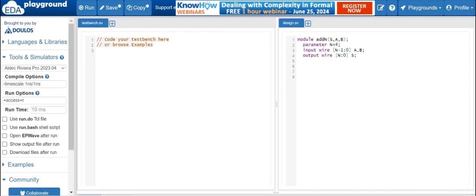And then if you want a 100-bit ripple carry adder, it is very difficult to write all the instantiations of full adder. So that's why Verilog provides us a for loop in those cases. Before using the for loop, as we know in C or C++, we use i or j inside of that: for i equal to 0, i less than some value, i plus plus. In that way, i we declare as int in C or C++. Here we need to declare it as genvar i, for i equal to 0, i less than or equal to n minus 1, i equal to i plus 1.